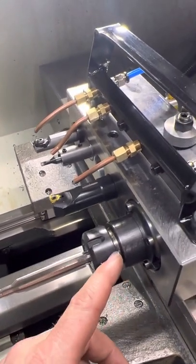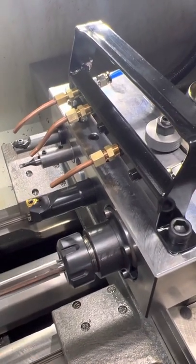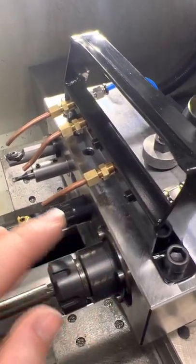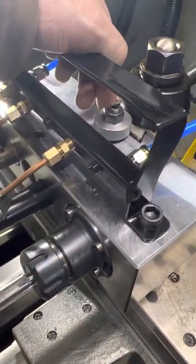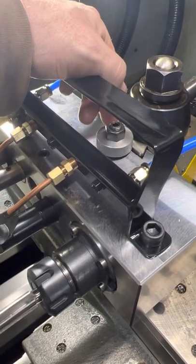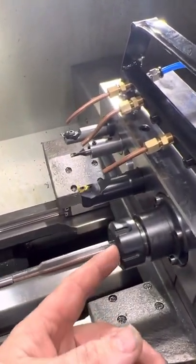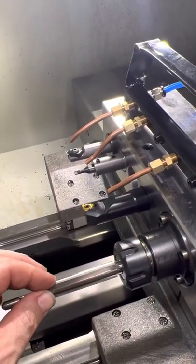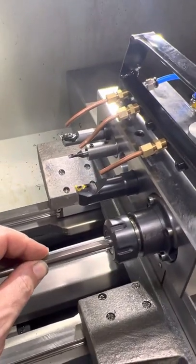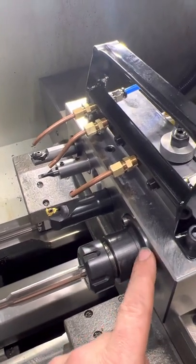The height and the X offset are set in the offsets on the CNC machine. The Y axis, or the height, would be set right here with the tool post prior to installing the reamer. A ground pin gets installed here. Angular and rotational is indicated in, and after that all that's needed is to install the reamer and make micro adjustments.